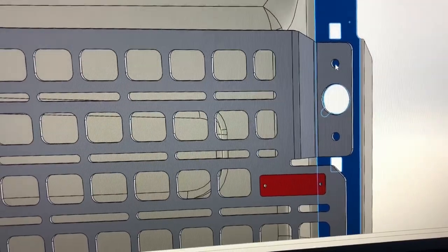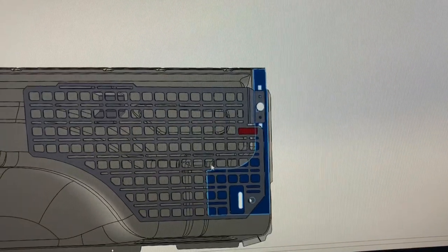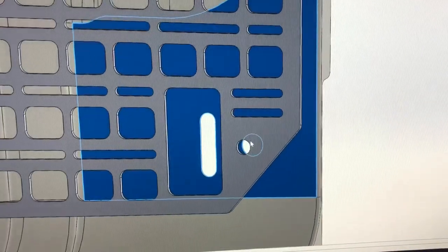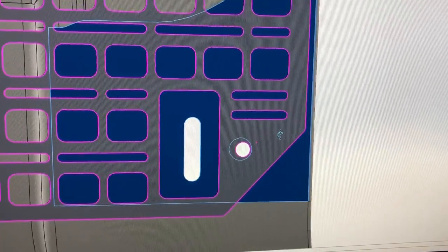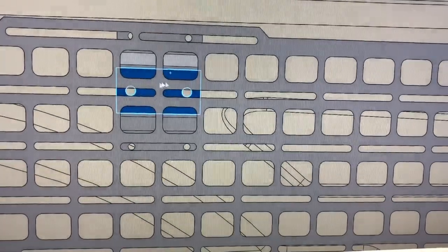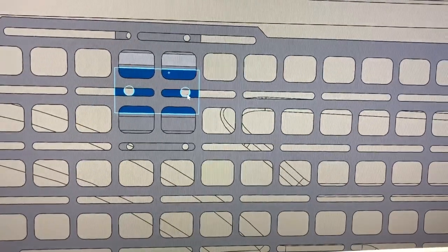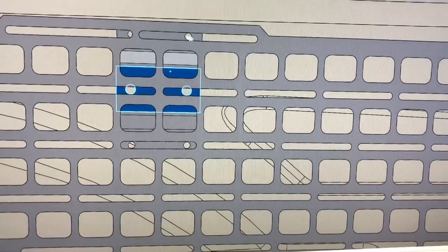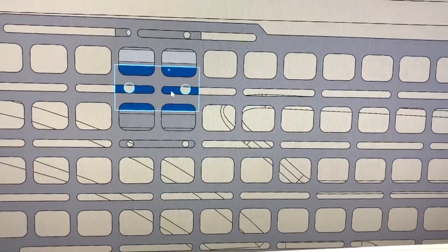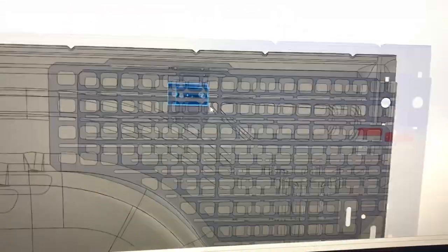I'm not going to cut this hole out of the actual panels — this is just for alignment and visualization purposes. You're going to drill two holes in this panel in the truck and install a threaded insert. We're going to use this hole down here next to your tie loop — that one's already there. I decided to decouple the mounting bracket from the panel itself to give us a little bit of wiggle room, so you'll install two more threaded inserts here.